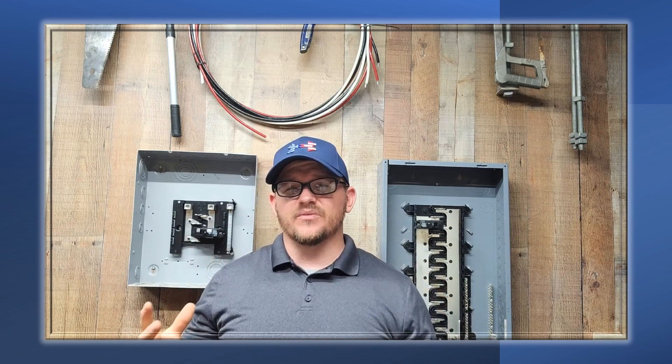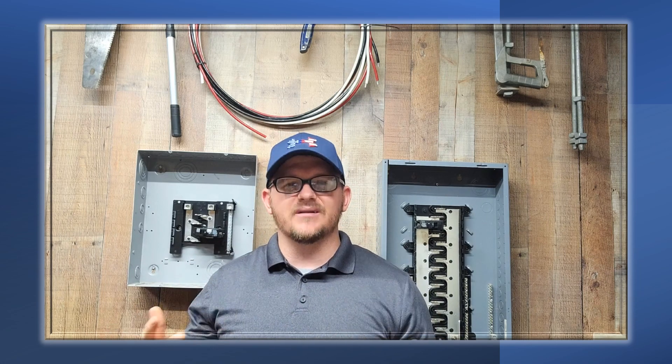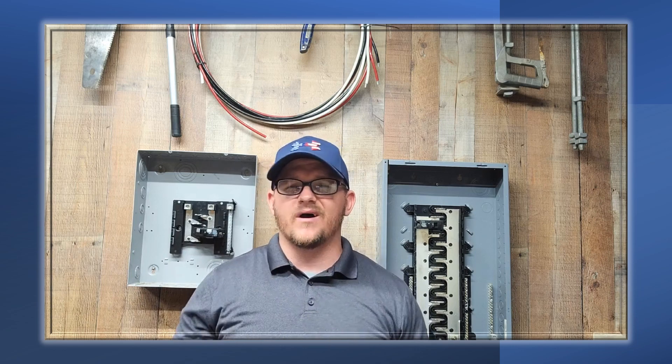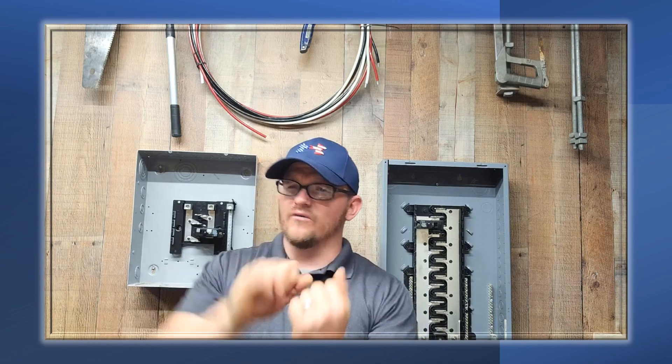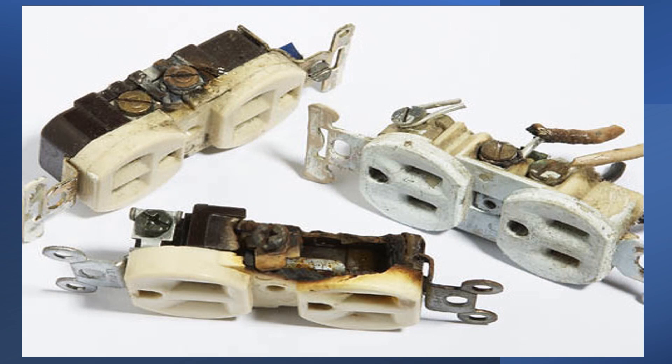So the first problem — the fact that it's brittle. If you've done electrical wiring in any capacity, you know it's already hard enough without breaking the wire. You can snap 14 gauge copper very easily — over-twist it, cut through it and snap it. Now imagine doing house after house of aluminum connections. Imagine how many twisted connections were broken right out of the gate. If you've ever over-tightened a breaker and broken copper, imagine how many breakers the first day they were put in were right at the breaking point — smushed to where just a little bit of heat, vibration, expansion, or contraction creates a totally broken connection. The fact that it's super soft meant the odds were stacked against it.